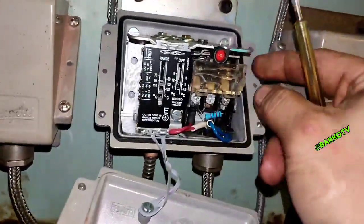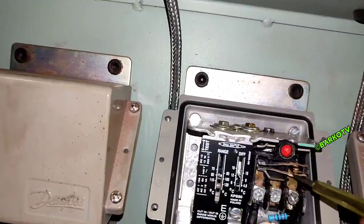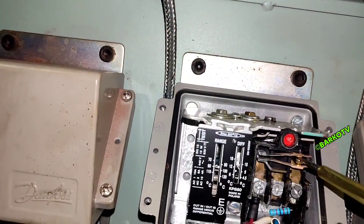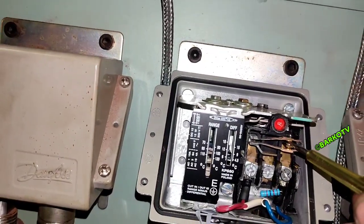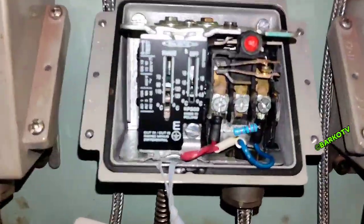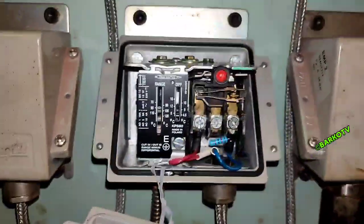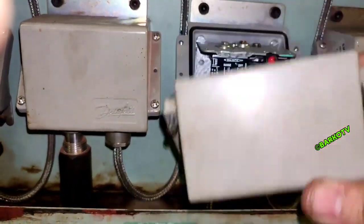The purpose of this resistor is to monitor the cable break. In the previous video, because this temperature switch is normally open, that's why I shorted that contact — so that will activate this HD temperature switch. If that resistor is removed from this loop, the cable break alarm will occur.